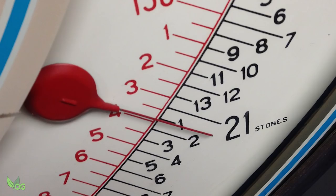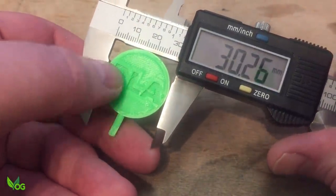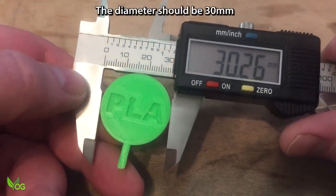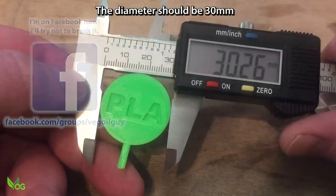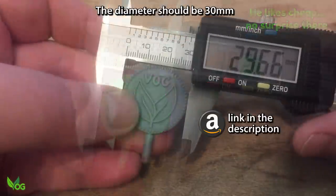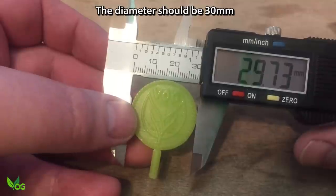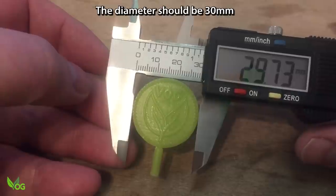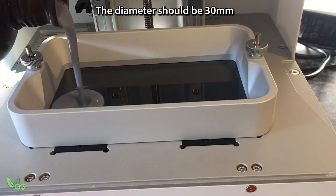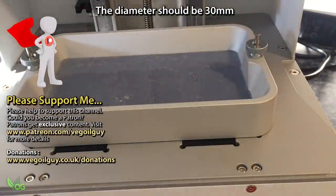I often get asked about shrinkage, and having a keen scientific mind — well, I generally can't be bothered if I'm honest — but you guys have asked me to do it, so I'll try my best. Our overweight contender is PLA, printed just a tiny bit oversized, at least according to my calipers. 4K resin is looking lean, just a smidgen under ideal. Bluecast Castable is also a little under, but not as much as 4K. This is interesting, as people often talk about size calibration being an issue with resin printers. But as this is the same model and the same printer, it seems to suggest that resin has a major part to play in dimensional accuracy. So if you're looking for the same size every time, stick with the same resin.